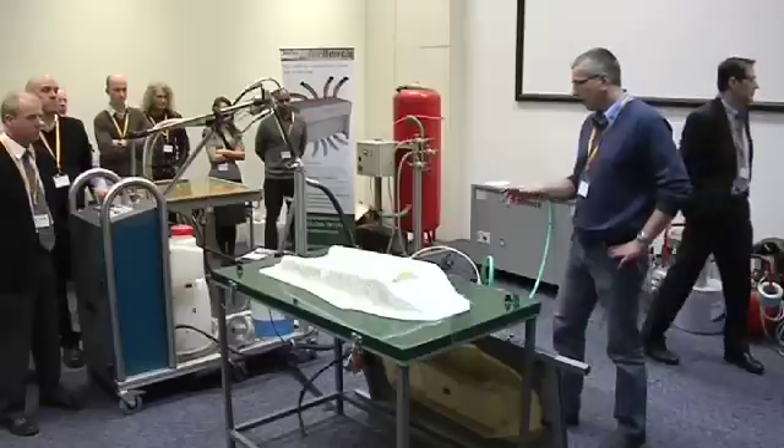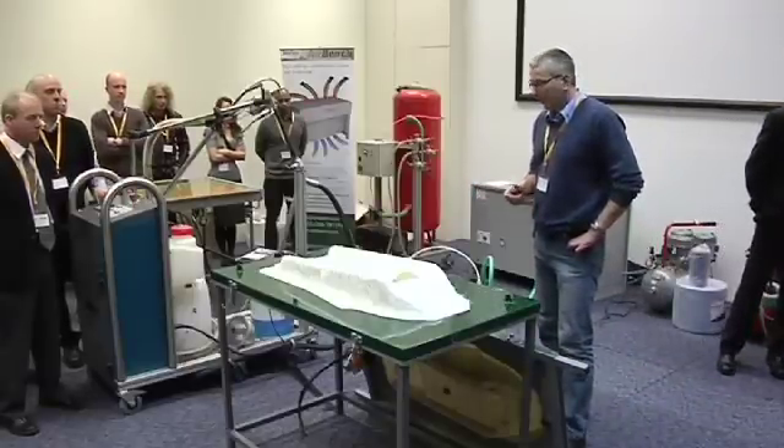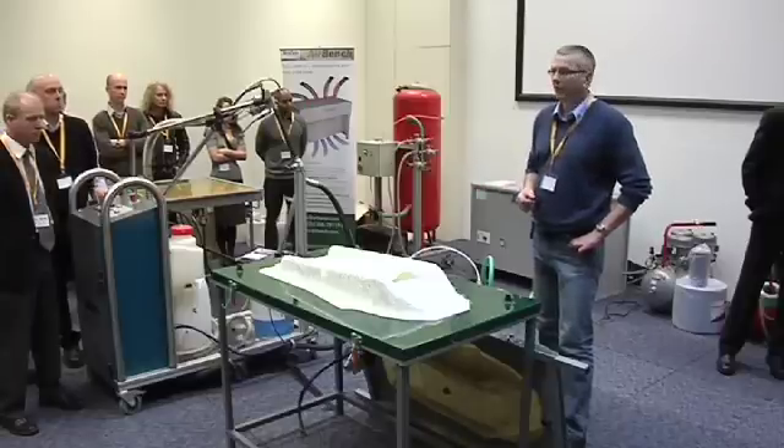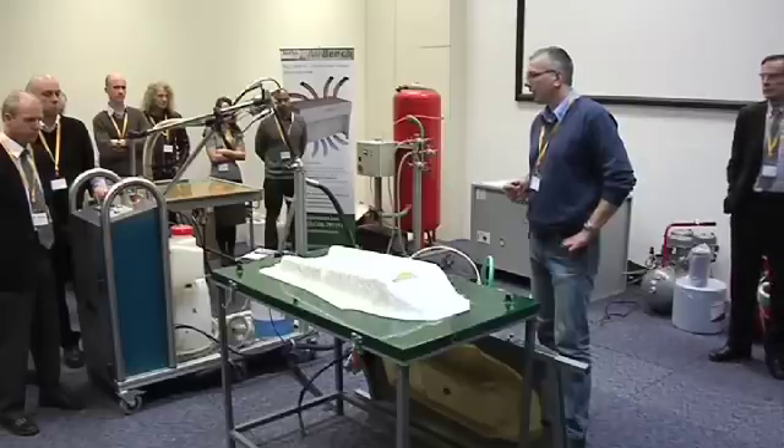In this case we're using a relatively lightweight vinyl ester high temperature composite tool. They can be heated as well — we often use water heating — but it can also work in metal tooling. Typically we'd use aluminium tooling for high production rate or high accuracy components.